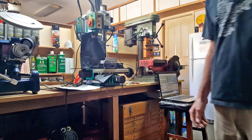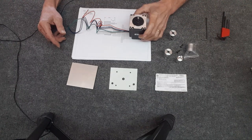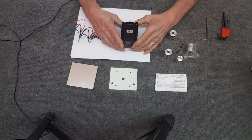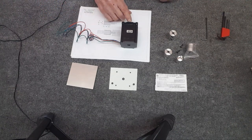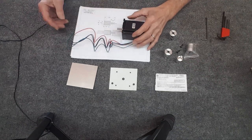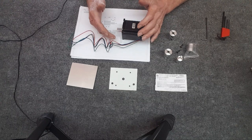Since the X-axis is fairly easy to do — since I've already done it once — I'm doing the power feed. First decision was what motor. This is a NEMA 23; I know it's going to be way overkill. When I first got the 3018, I was just playing with the NEMA 17 motors on the bench — tremendous amount of force, and really easy to turn by hand. So if you wanted to do a power feed, you wouldn't have to disengage it if you used the 17, because you can barely feel it, yet you cannot stall it with your fingers. I probably could have gone with the 17.